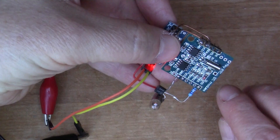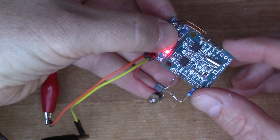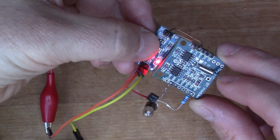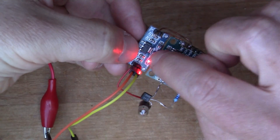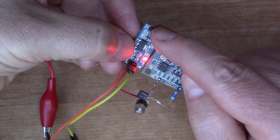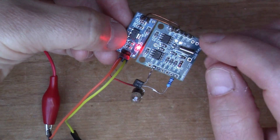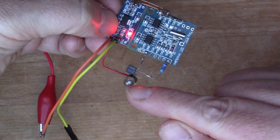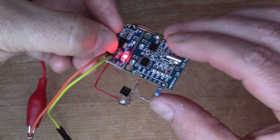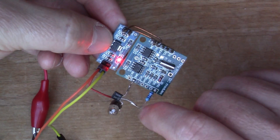The main part of the unit is this tiny RTC board — one of those cheap clock boards you can get for the Arduino. There's a regulator here because we've got the 12 volts being switched down to 5 volts, since the tiny RTC needs 5 volts. But I want to run the incandescent bulb at 12 volts to get a good level of brightness.